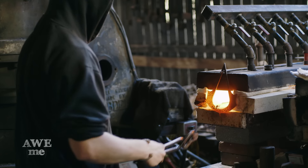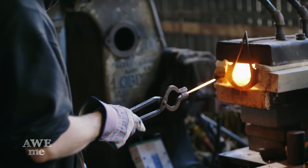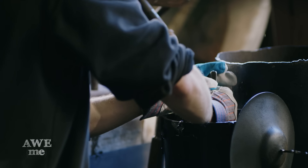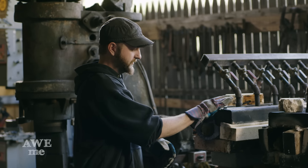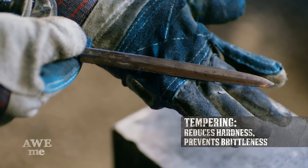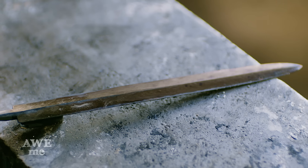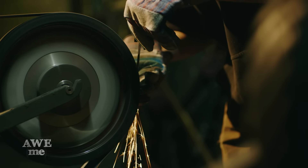This dagger blade being much smaller than most sword blades we heat treat, I have to be very careful to make sure I don't burn the tip or the edges. Using a pair of tongs, I remove the blade from the forge and quench in oil, then move on to the vise for straightening. I place the blade on top of the forge, where the radiant heat of about 500 degrees is perfect to temper this blade. The middle of the blade is our good straw color, the edges are just barely plum — that's right on the money for the temper that we want. After tempering, it's now time to polish the blade.